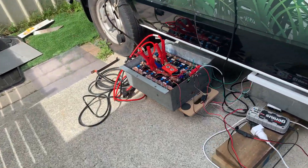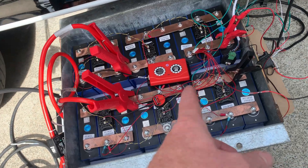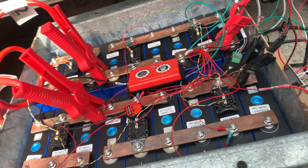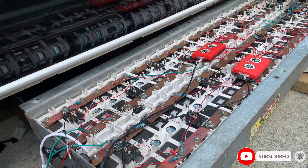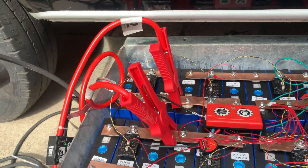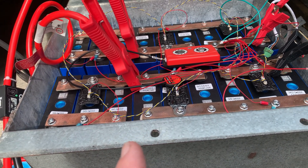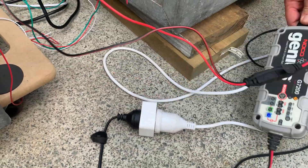So this is the battery we're replacing. The comments section said we should get an active balancer - we got an active balancer, though it's not plugged in. My brother read the comment section and went out and bought a whole heap of active balancers, so now there are active balancers everywhere. I'm manually charging those four cells with a lithium charger - lithium charger on lithium cells.